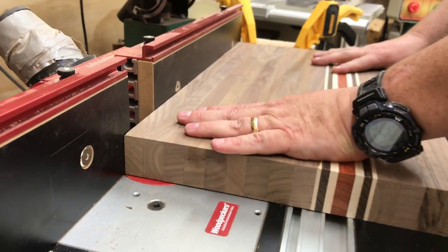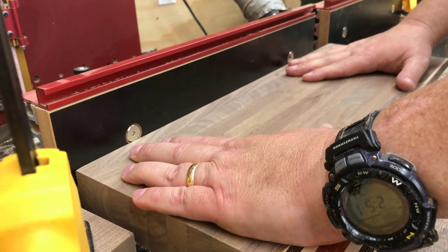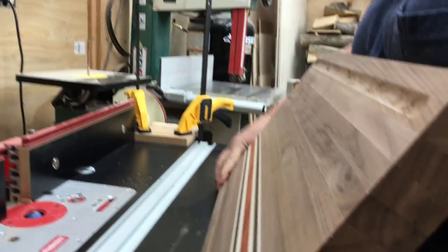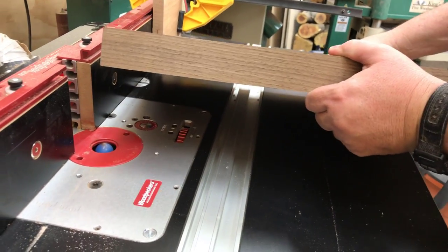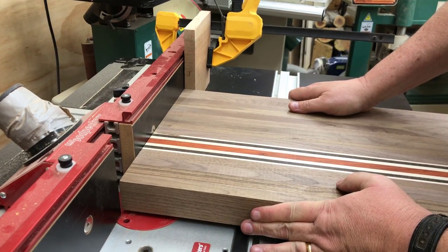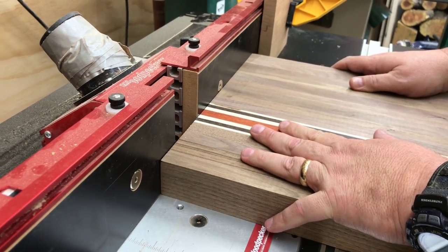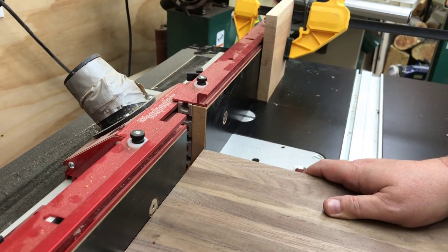You've probably seen cutting boards with a groove around the top — in the industry they call that a juice groove — and my daughter Kavita wanted that, so we decided to put that in. The bit I'm using is called a core box router bit; it's basically just a half circle and it cuts that groove. I'll put a link to one in the description. We just have a stop set up on either side — I slowly lower the board over the cutter at the stop on one side, move it until I hit the stop on the other side, and lift it up slowly for a nice clean cut.